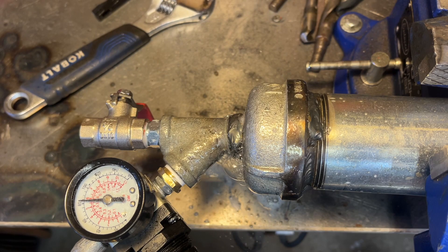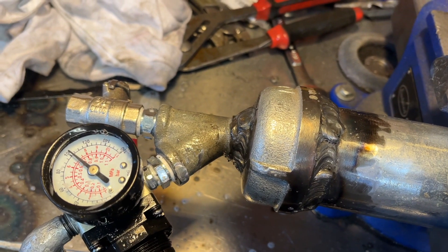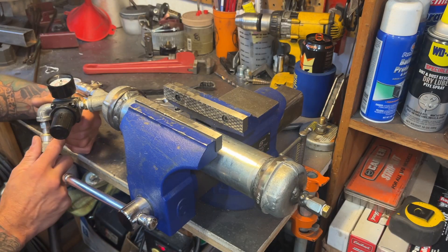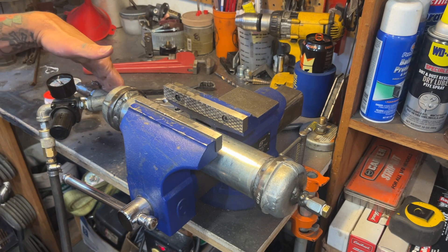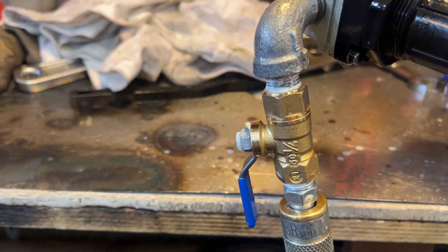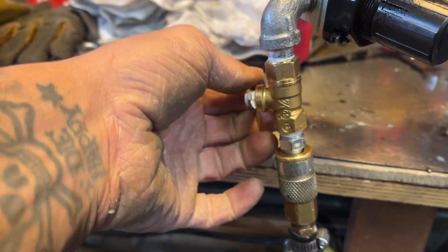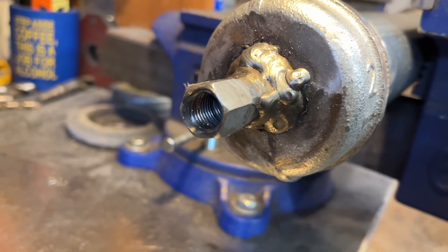Let's see you leak now. Finally I got it to stop leaking and now it's holding at 100 PSI. But as I was thinking about this, I came across a flaw in my design. In order to do the pressure test on your injectors, you've got to have a way to shut off the air supply. Because if the air hose is constantly hooked up, your air compressor is just going to kick on when the regulator says to, introducing more pressure into your cylinder, which defeats the purpose of checking for leakage. So I got a quarter inch ball valve so now we can shut off the air supply and test the leakage based on what the gauge on the regulator says.